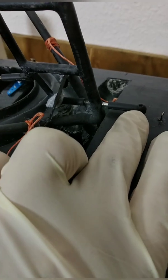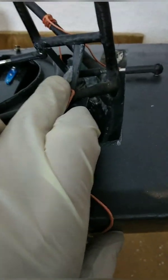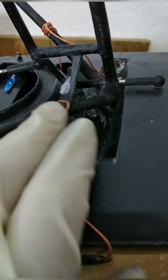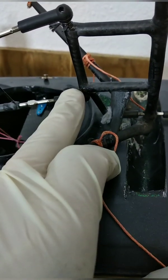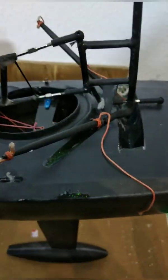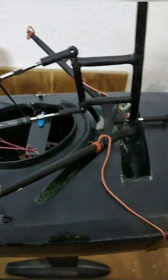What I discovered is that on the front ball joint there is literally no load at all — maybe we can leave it out of the system. The only issue is we cannot build the ball joint just beneath the mast, because then the whole system would start to rotate when we are foiling downwind and the boom is pushing not straight.